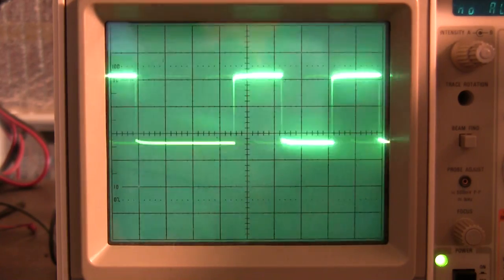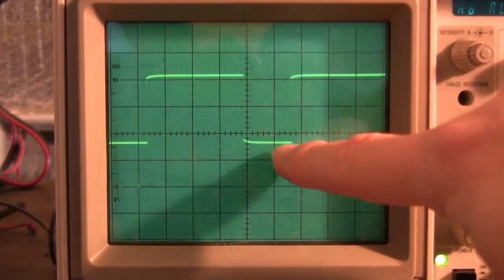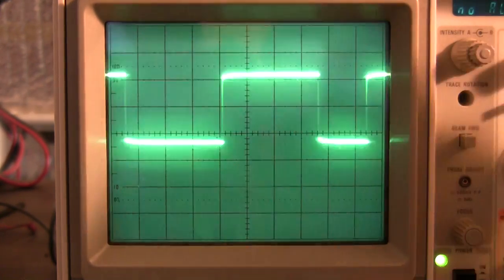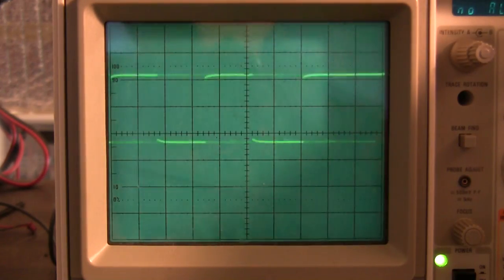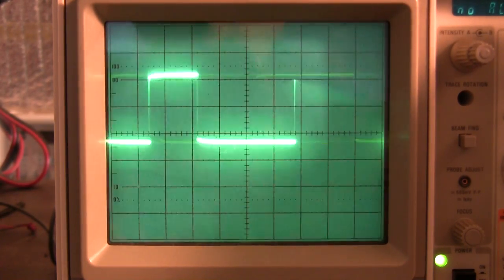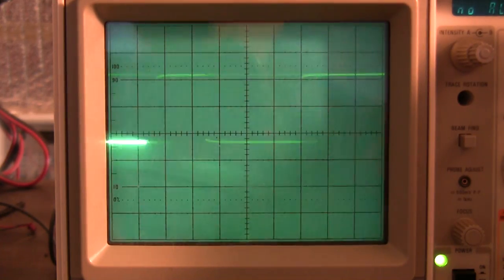Let's try 5. Right, so that looks a little different from the least significant bit there. There's a 1. Skip that one. That's a 0. Skip that one. There's a 1. Skip that one. It's a 0. And just zeros. So you've got different codes like that just in these last 6 bits that describe the command you want to execute.